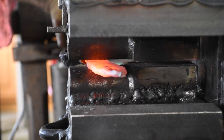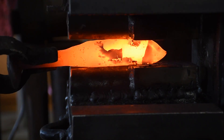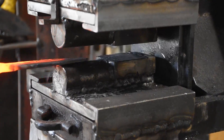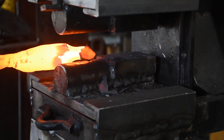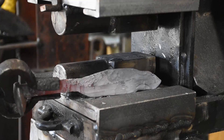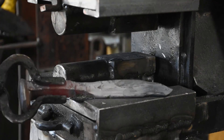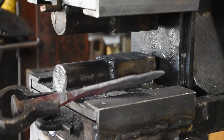It's a very powerful tool. It's important to keep it moving and keep the metal hot, or otherwise it just sits there pushing hard against metal that doesn't want to move at all. It's important to know when to stop using the press and go back to the anvil. In a few minutes I feel like I was able to knock out a blank out of a railroad spike, even though I messed it up a little bit. And from here on out, the more dies I make for this thing, the more it can do.